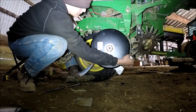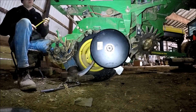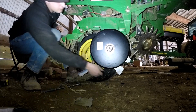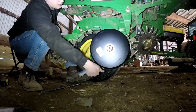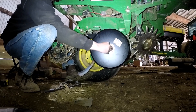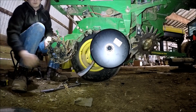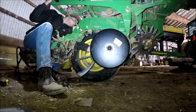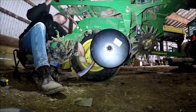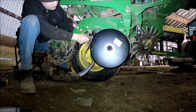I'm actually glad this part is done, because now I'm doing the roller chains — I don't know if I'm going to have a chance to do it today. Ryan already did a bunch of the roller chains on the drive unit, well, until he ran out of chain, but that isn't an issue anymore. Now I'm going to be going through all the row units: the roller chains, grease the planter, put the soybean cups — you see I've got the dust cap back on — put the bean cups back on the seed rows, put my seed box extensions on. The insecticide boxes aren't going to go back on; I've already made that decision.